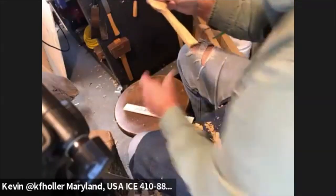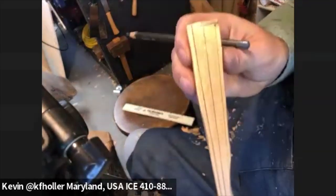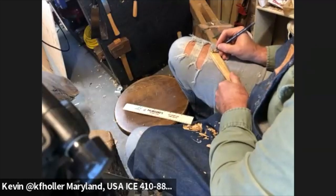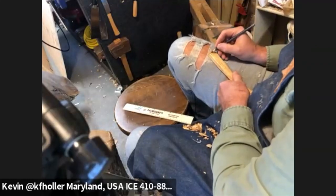All right. How are you doing? Great. A little bit of a rounding on the bottom, unless you just want to do that by eye. Right, I can do that. On the bottom, you mean the very edge of the handle, right? On the end of the handle, the terminal point of the handle. Great. And now we're going to go around the sides again, but this time we're going to care about how close we get to the line. Okay, so I'm going to do the planes around the outline, perpendicular planes around the outline of the pencil line.